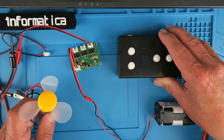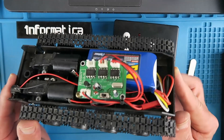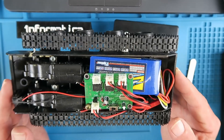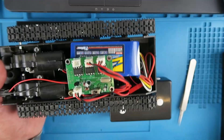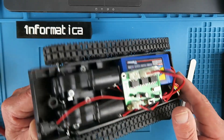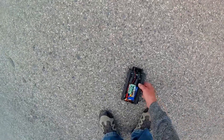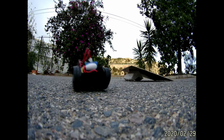So we've built ourselves a little remote control with the possibility to drive three motors. I've had this little tank mechanism for some time, waiting for a suitable project, and I don't think we can find a more suitable one than this. I've gone for broke and put in a three-cell LiPo, so that's nominally 12 volts, which is the maximum. I've wired the motors up — forward and reverse on each track, so that should get us forwards and backwards. It turns out that my tank driving skills leave something to be desired. My thanks go to Juanita at IC Station for supplying the transmitter and receiver kit, which I'm having an awful lot of fun with.